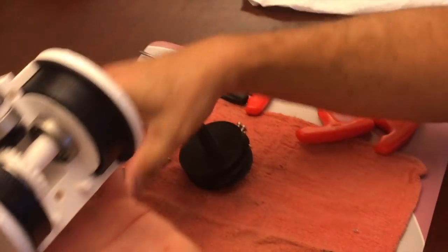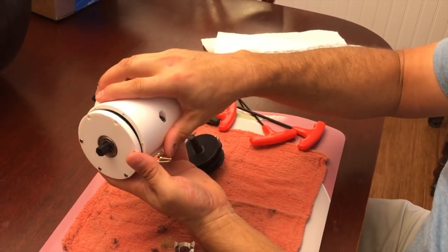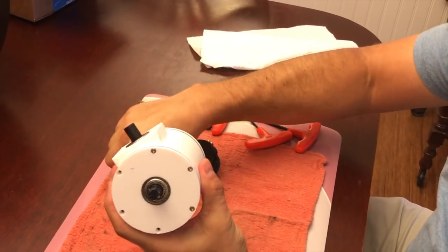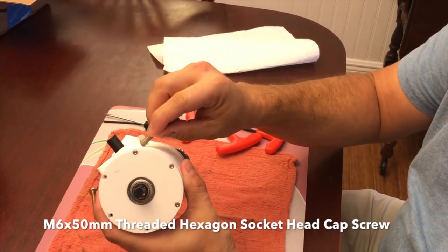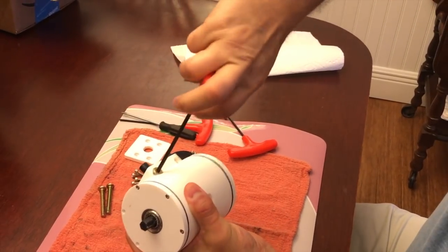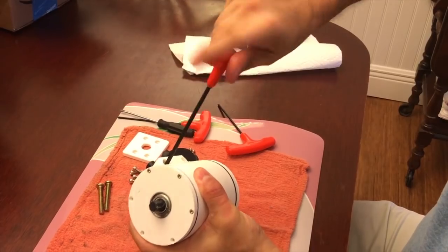That's the gearbox that I've assembled. The goal is to make this even smaller and to continue improving the quality of the gears using different materials. Right now I'm using nylon for all the gears inside, all the housing, all the drive shaft. The outside is ABS. I wanted some flexibility to be able to sand if I needed to reduce a little bit of space.